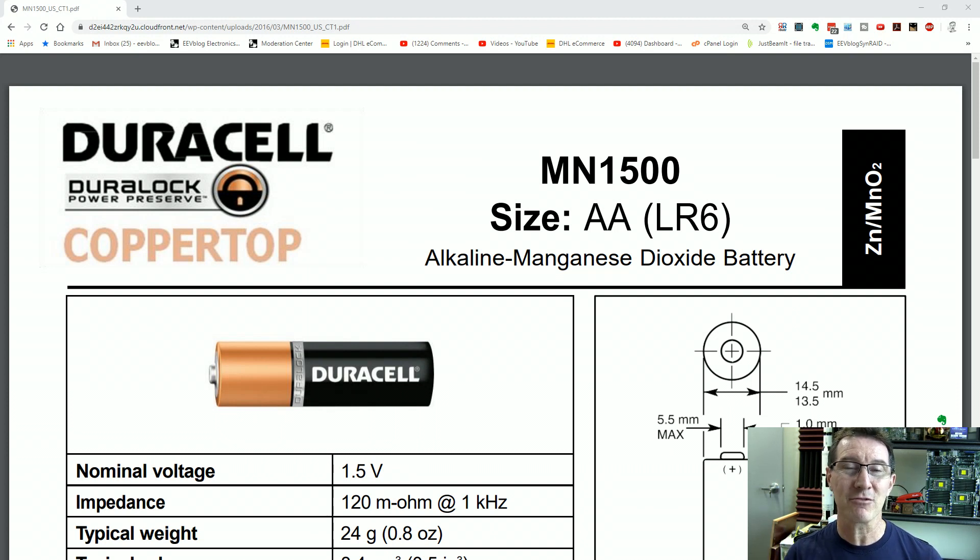This time, I'll actually discharge the batteries either 90% or 100%, then put a light load on it — like a 100k resistor. So 1.0V divided by 100k is 10 microamps, which is a fairly typical product standby current. You get leakage in a lot of equipment that has soft power buttons and standby modes, so I'll change these resistors to 100k. Please leave comments if you disagree with that approach.